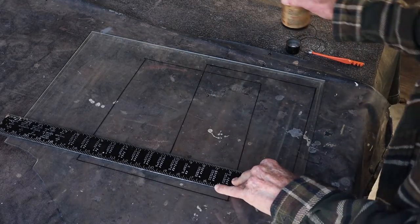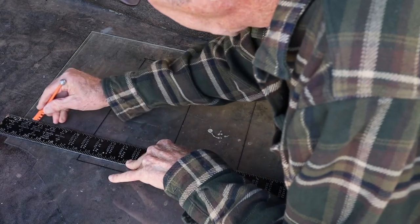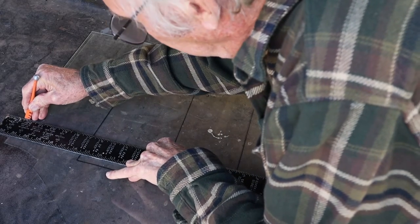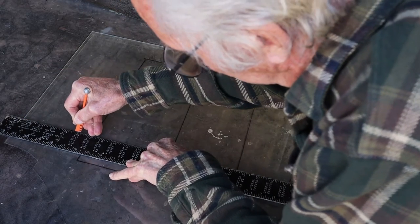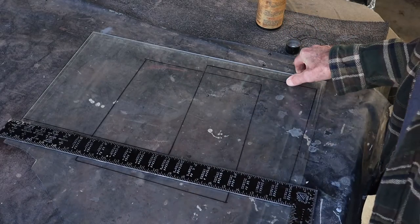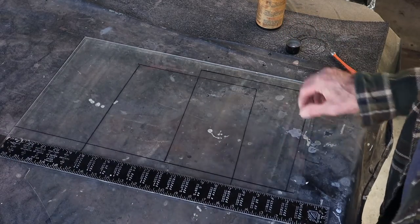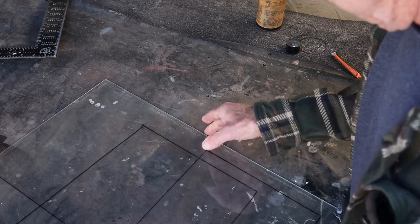Some people put a little oil in the glass cutter, some put their glass cutter in oil — it doesn't make any difference, it just needs a little lubrication. Kind of a false start there, but nice and even, steady pressure. And with a little bit of finesse, we'll just snap that right off of there.